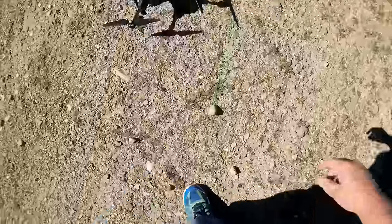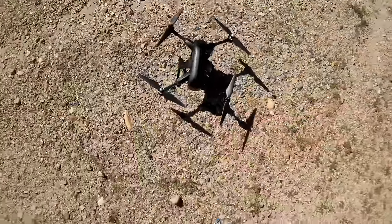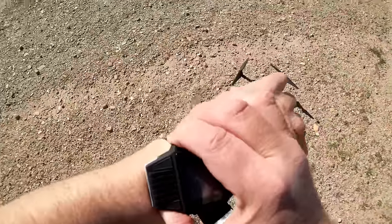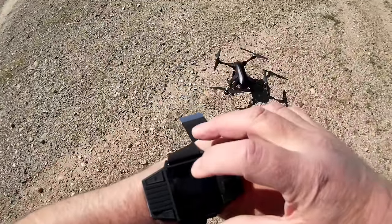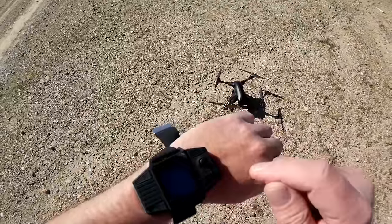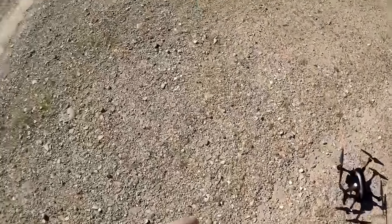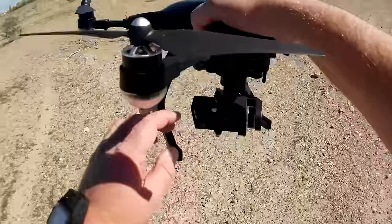Now we turn on the quadcopter by holding down the power button in the back, and wait a few seconds until we hear the ESCs. Then we turn on the transmitter by pressing and holding this button on the left. After turning on the quadcopter, we wait a few minutes to check the satellites. Right now I've got 16 satellites on the quadcopter, and I'm waiting for sufficient satellites on my watch — now at 11. We have sufficient to fly, so we're good for both follow me and controlling the quadcopter. I'm going to press the record button manually and remember to turn off recording when we land.